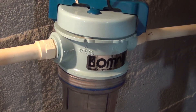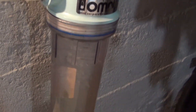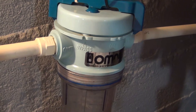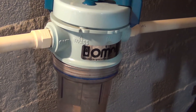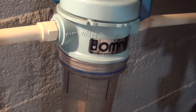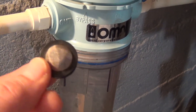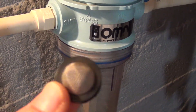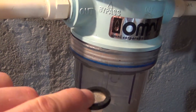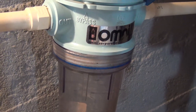What I wanted to show here is this is a water filter, but there's no filter in it at the moment. This is where it comes in from the well. With iron bacteria, we took the filter out because it starts stinking after about two weeks. What we did for a while is we stuck this screen filter basically where the output goes to the rest of the house.